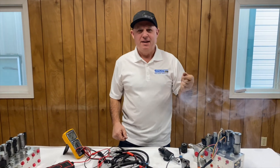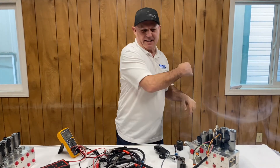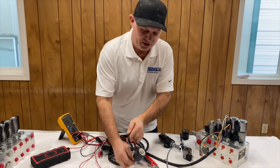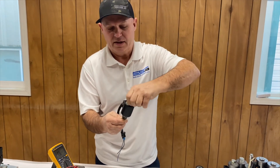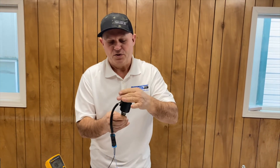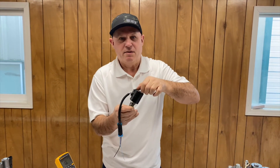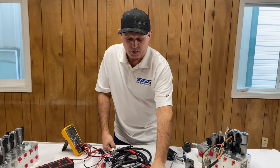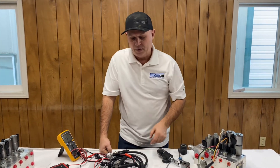That's what a bad coil looks like, and there'll be a burned plastic smell. So if you get up next to your attachment and suspect something's wrong, the first thing I do is give it a little sniff — if I smell that burned plastic smell, I know that's exactly what's wrong. These coils are really simple to change: there's just a nut on top, you take it off, slide the coil out, and put a new one on. If you don't buy from Bobcat, you can get them on the open market for about $40-$45, and they're on our website too. Just verify the part number to make sure the wiring and diode setup are correct.